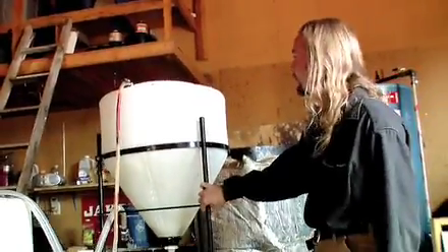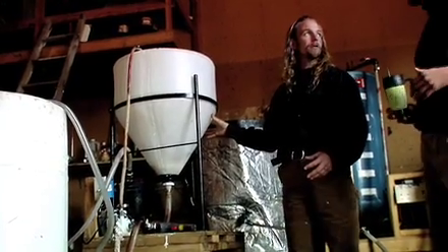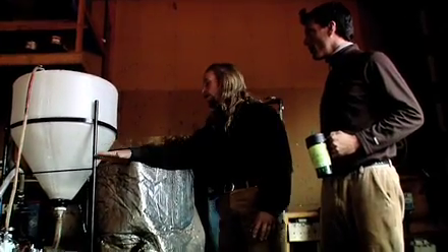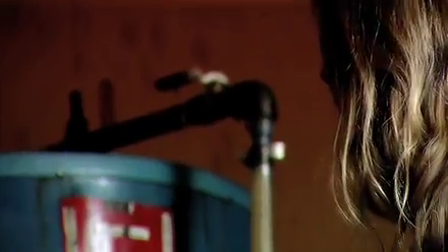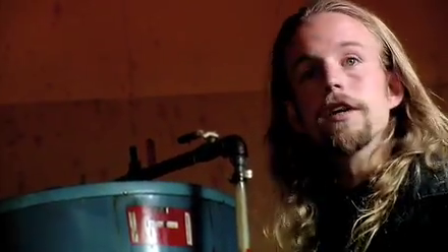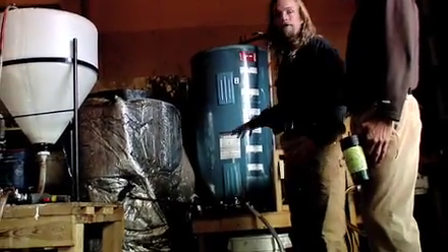Back to the process. What this tank does is mix our methanol and lye together. The process of making methoxide is an exothermic reaction, so it's producing heat. And when you feel this, you know that the process is happening because there's warmth coming from it. We pump our methoxide into our processor here and blend it all together with the circulation pump. What we get from there is two products: we get our glycerin, which can be seen in the bottom of our sludge tank here, and we get our biodiesel. The glycerin falls to the bottom, so we let gravity take out the glycerin, and we have only biodiesel left.